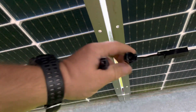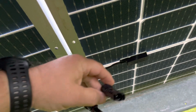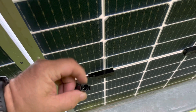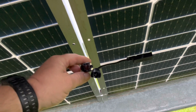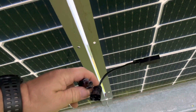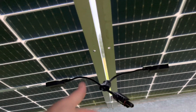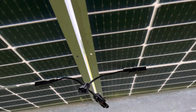If you look at these MC4s, as the sun comes up these panels will be putting out power with nothing hooked up. This side is the negative, the other side is the positive, so there's actually going to be power on this panel up to 50 volts. But the metal parts of the connectors are recessed, so you really don't have to worry about getting shocked as long as you don't get yourself in series or poke something in there.